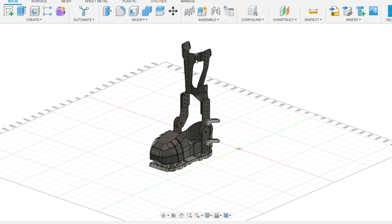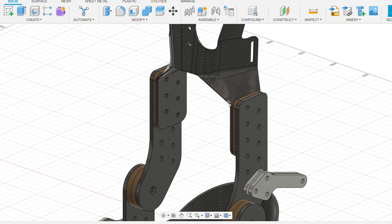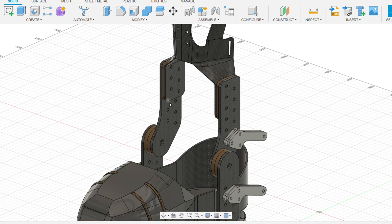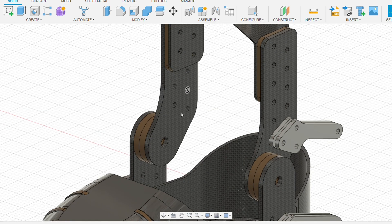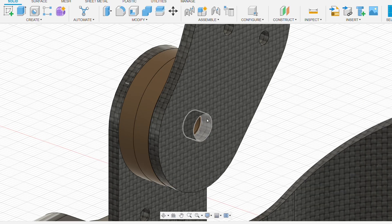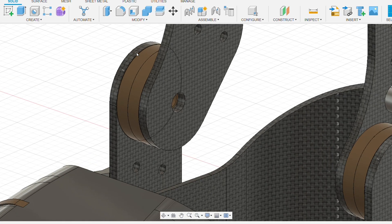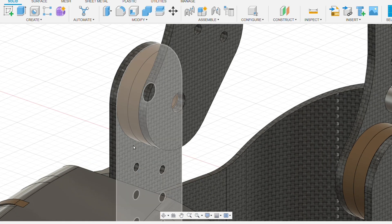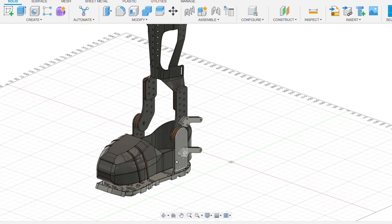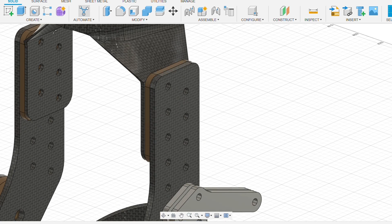You can see the shin piece from the last video, and moving down from that you've got the ankle attachments. There'll most likely need to be a spacer going in between the ankle attachments just to space out for the ankle point and position. We've got 5mm carbon fiber brackets, and I've realized a slight angle is necessary to correctly line up with your ankle. There'll also be two spaces acting as wear shims with space for a shaft to go through the middle — I'll put a bit of grease in between there to make sure the movement's good. That attaches to another 5mm piece of carbon fiber. I've wanted these to be separate pieces compared to the main exoskeleton pieces like the shin piece — this allows a degree of adjustment up and down on the bolt holes.